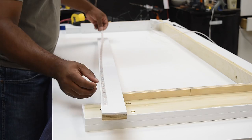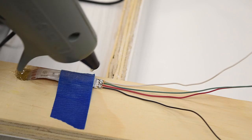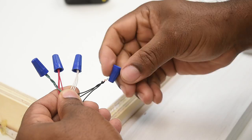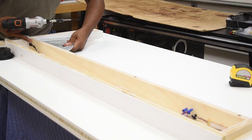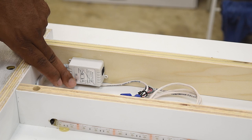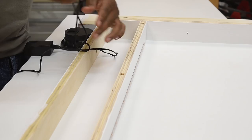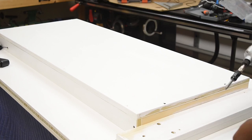After adding the strip on the back, I thought about why not add it also inside the storage area — but after seeing the end result I'm still not sold on whether I like it or not, so you guys can make the call on that. After soldering on the necessary conductors I hot-glued the connection into place so it didn't move, then fastened the harness and spliced the two harnesses together. From that splice point I ended up with one cable that gets plugged into the LED controller. I attached the second piece of lumber which gives me support for the bottom panel and storage on the back side to hide the LED controller. Utilizing the same hole the LED passes through, I can stick the IR receiver in that same location, then run the transformer through the hole drilled on the far side, tie a knot in it, and plug in the controller.